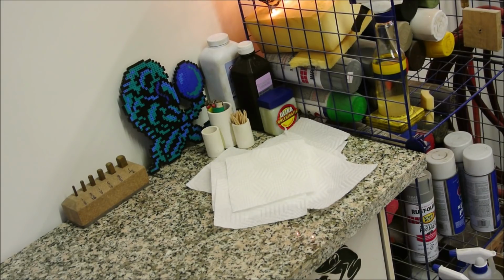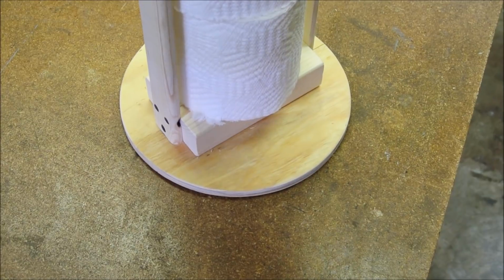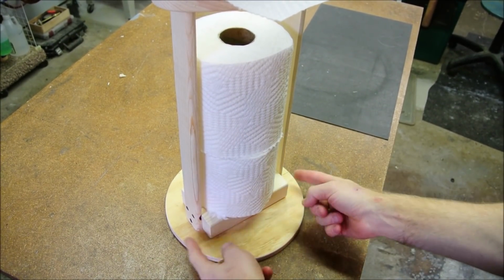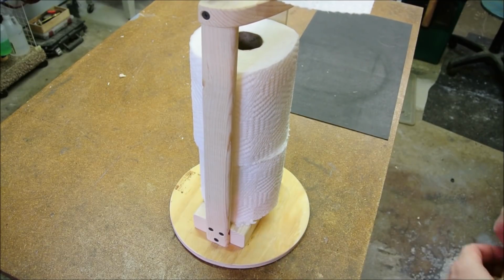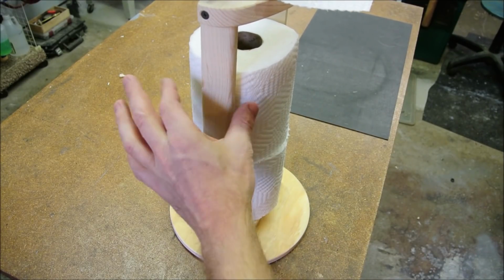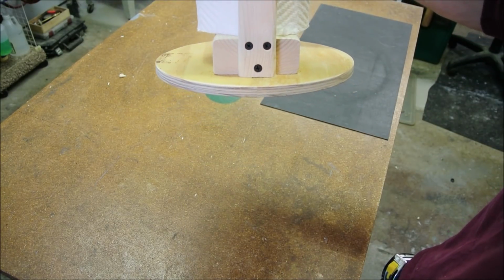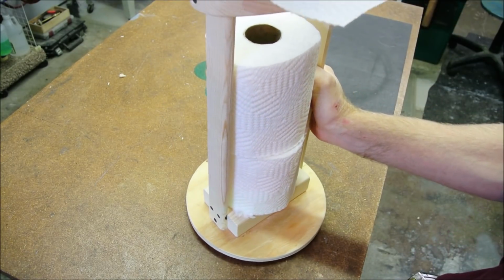But not now. Okay, let's go back to reverse engineering this thing. Where were we? You've cut a 6-inch block. You put the 23.5-inch strips onto the sides of it. Look, 3 drywall screws, probably 1.25-inch screws.